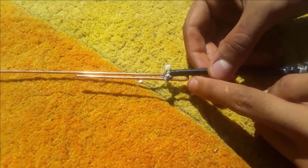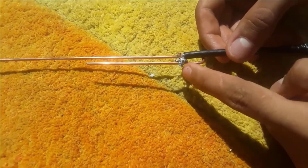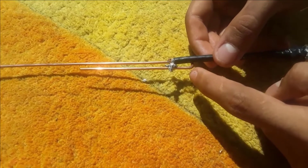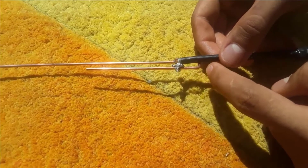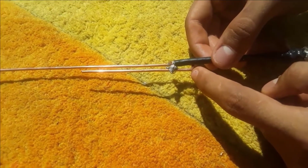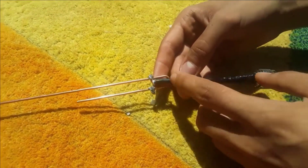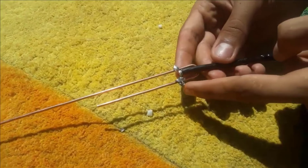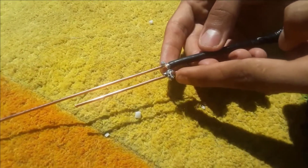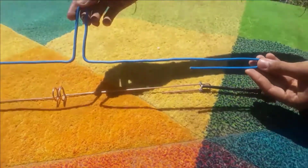As you can see, to have an impedance of 50 ohms, you will have to solder the feeder from this point — it should be 1.8 centimeters up — to achieve that 50-ohm impedance. Also, the conductor from the feeder should be soldered on the long part of the J-pole antenna, and the ground wire should be on the short part.